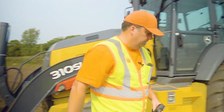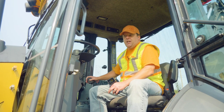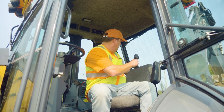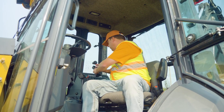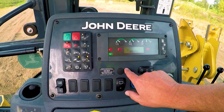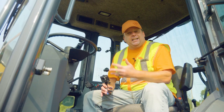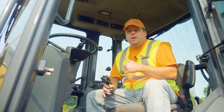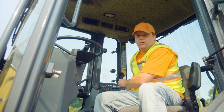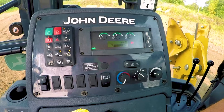The third and final step is getting in the operator seat. First, I just make sure there's full range of motion on everything and no damage. You can check the backhoe controls in the back too, seeing if anything is obviously damaged. After that, I go ahead and start it up. Seeing once I turn the battery on that there are no warnings or indicators that would tell me not to start it. I'd also like to consider the startup part of my pre-op — it's more audible: is there anything that doesn't sound right? Listening to the machine, and then seeing if there are any indicators as I go. Finally, I check my fuel level to make sure nothing is abnormal.